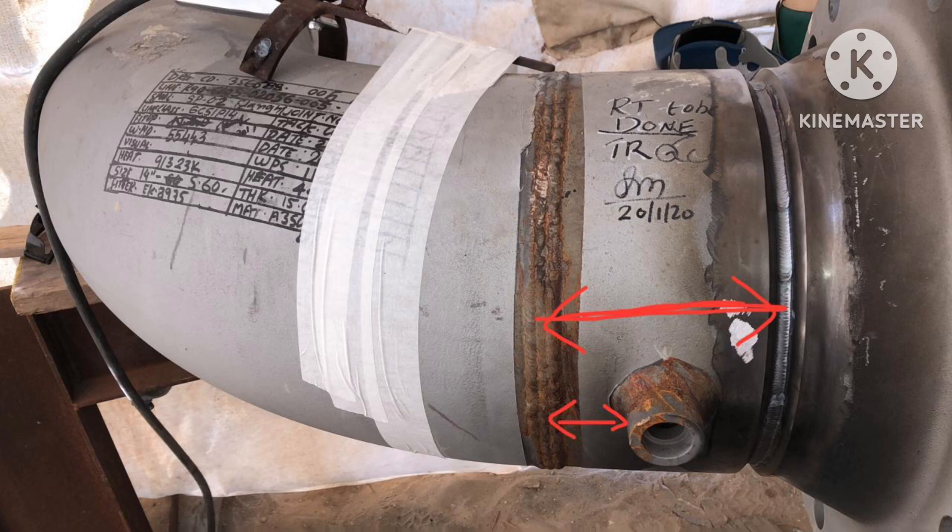When both joints are too close, the stress will be more, so we have to relieve the stress by performing PWHT. If it is stainless steel, PWHT is not possible, so we have to follow the client requirements — whatever standards or procedures they specify. Thank you.